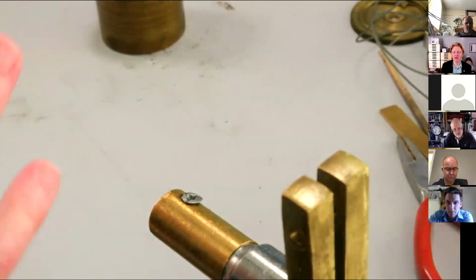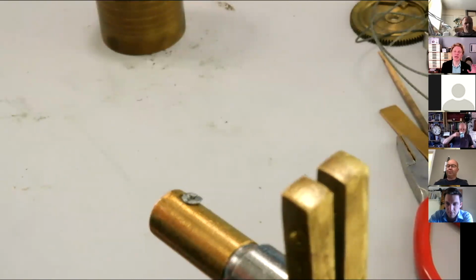I made a video on it again. Take the barrel cap off, take the barrel arbor out, clean the bearings, add a little bit of lubrication as a kind of confidence building exercise to get your first spring done. But actually, as part of practice, if you're going to repair many clocks, then you need to buy a mainspring winder, I would say anyway.